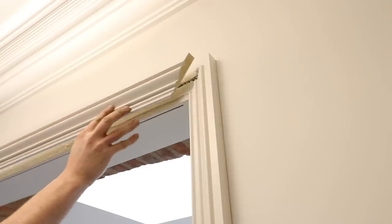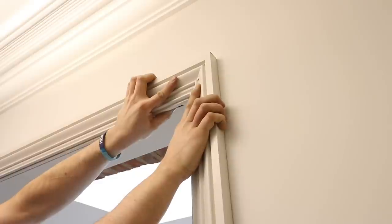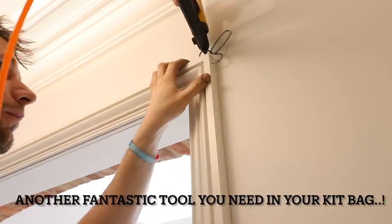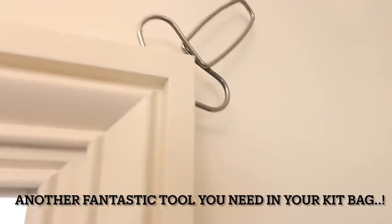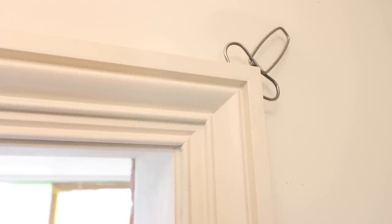Previously, whenever I've used a pin gun, you sort of fire and then release the trigger all in one operation, and it's the release of the air and the trigger that causes the gun to bounce and it dents the wood very slightly. So my friend was using it and he discovered that if you just pulled the trigger and held onto it and then removed it from the workpiece before releasing it, it didn't actually make any indent at all. It's almost invisible. So he's called it Wom, so now it's got a label on the side of the pinner called Don't Forget to Wom It.